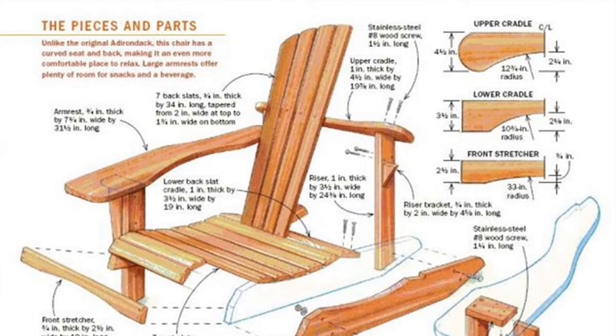2. Lay one side rail flat and put a nail in the center of the intersection or midpoint of the front leg and the rail, about 8 inches from the front end of the rail. Stand the leg up and check to see that the back of the rail sits flat. Trim it with a router or jigsaw if it needs to be adjusted. Add a second nail to hold the angle on the front leg and trim the back of the opposite side rail, if necessary, to match.